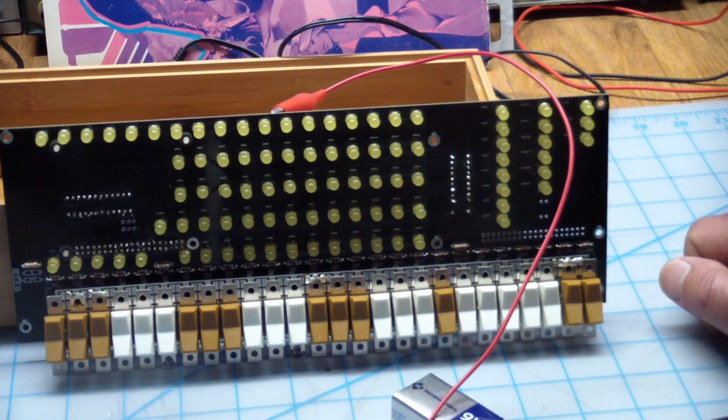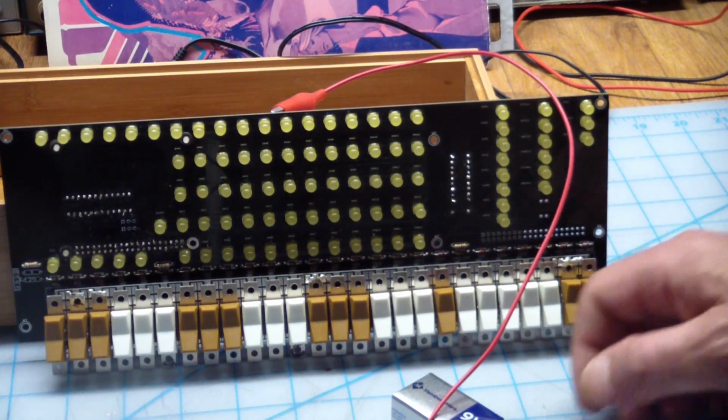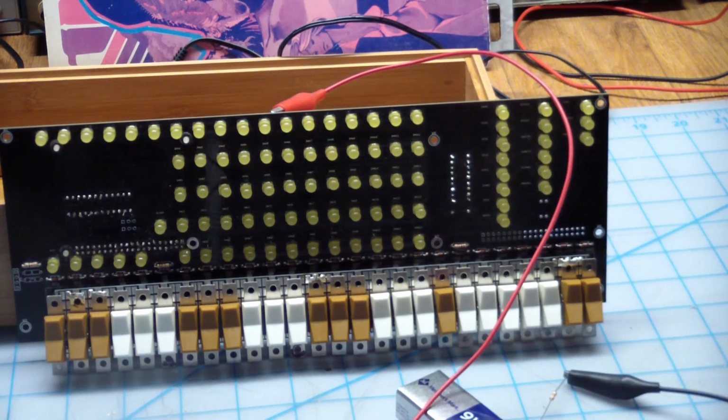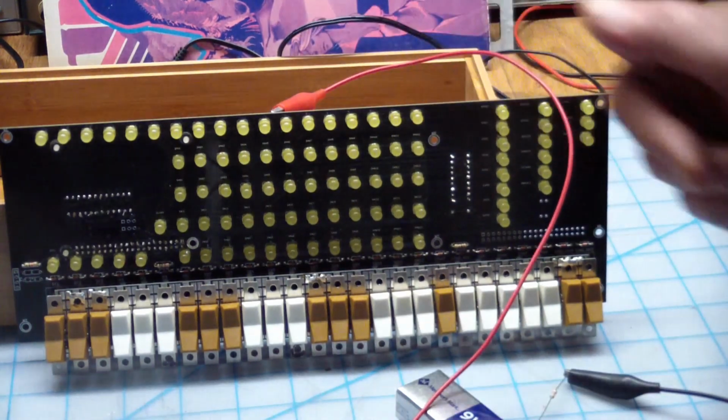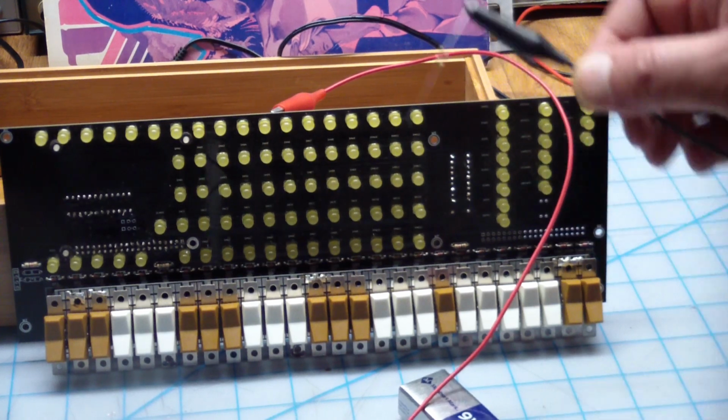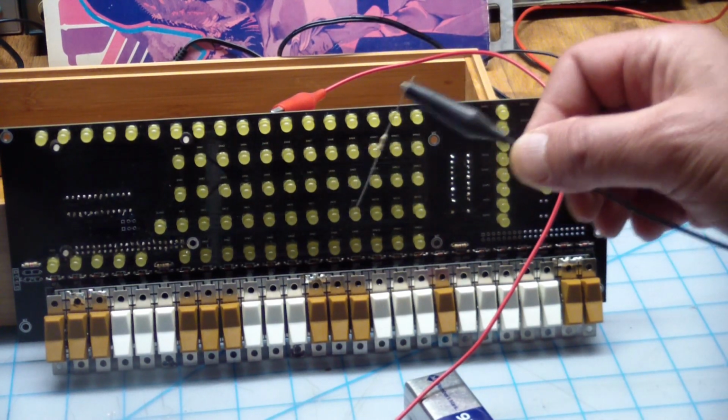And remember, I also said LEDs very rarely go bad. Well, there's one easy way to burn out an LED, and that is to power them up without this resistor. If you put 5 volts or 3.3 volts straight into an LED, I mean, these yellow LEDs have a forward voltage of about 1.9 volts. And if there's no dropping resistor in line, the LED essentially acts as a camera flash, i.e. it gets very bright and then it dies forever. So if testing LEDs or doing this, make sure you get a dropping resistor.